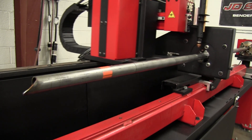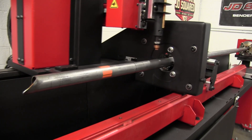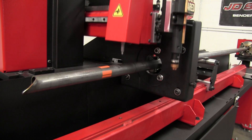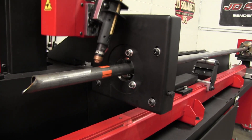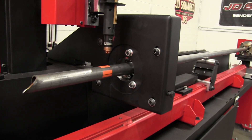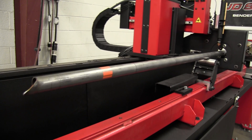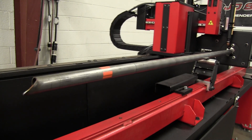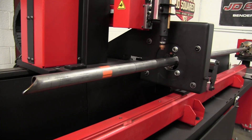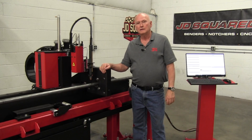Now we have the front view of the tube stabilizer in the forward position. You can see the balls opening and closing — they will only do that when an operation is being performed on the material, whether marking, scribing, or cutting. We're only able to tilt 30 degrees and only towards us because the stabilizer is in the forward position. If we wanted to tilt the other way or do a longer notch, we would move the stabilizer to a more rearward position. Notice that as the mechanism travels up and down the tubing, the balls are disengaged — they are not dragging.